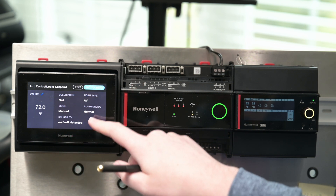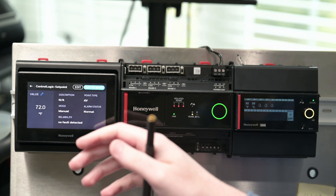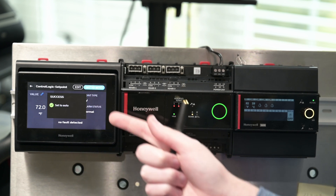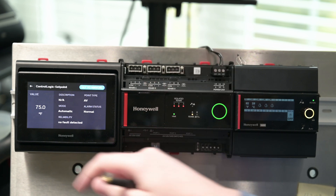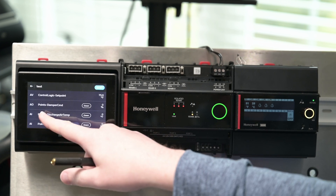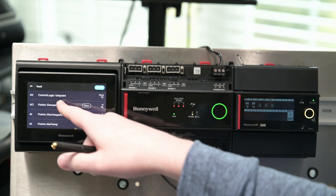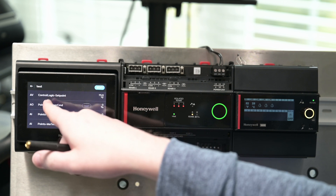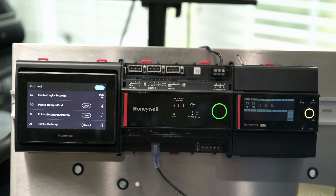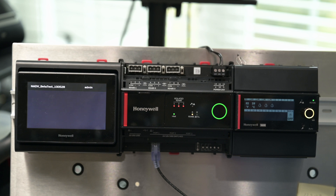The display, when you make a change on it, is basically going to override the point. And then you have the ability to go back to auto, and it'll roll back to the previous set fallback default value on that point. Another thing worth noting is that the way point names show up here is configurable from within your station through B format. So you can see we've got a display name and then a parent dot display name showing up for those point names in this particular use case. But since it's B format — typical Niagara stuff — you can do whatever you want there.